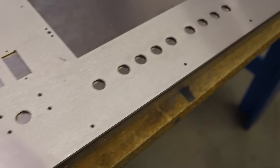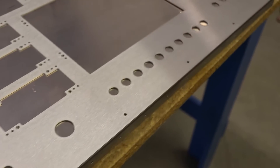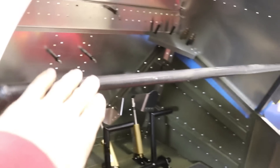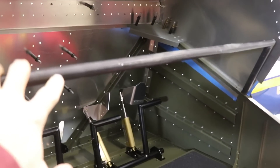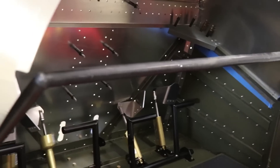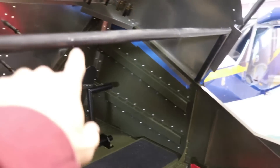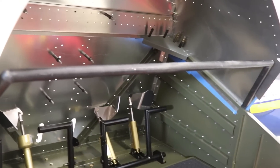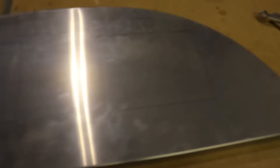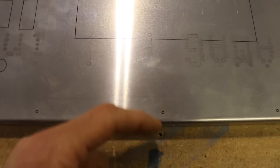You can see these holes along the bottom — the screws that go in these holes will get threaded into the steel frame. So this is the bar of the frame that those screws will go into. I'm hoping this might be thick enough to get maybe one or two threads on the tube so that I can just thread those screws in here. I'm going to wait to drill those holes because I'm not sure exactly what size I need to make them yet. Before I removed the panel, I traced some of the holes in here just so I kind of know where to cut. I marked the holes with pen on the bottom so I kind of know how high to go.